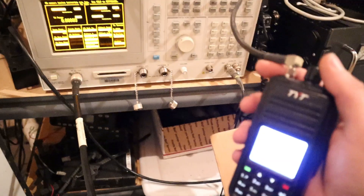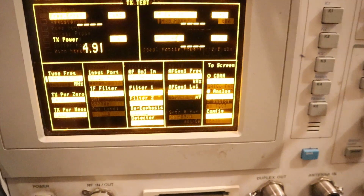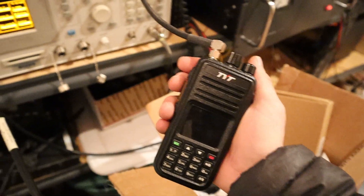For each mode, a radio will be set up on both the transmit and receive end, separated by a few miles. On the transmit end, each radio has been tested for frequency error and output power at 5W, so all radios will be transmitting the same output power. On the receive end, radios have all been tested for good receive sensitivity. This will be a mobile multi-path test throughout a city environment and rugged terrain, giving a better idea of true coverage. If we were stationary, we might be in a null or a peak — moving just 2 inches can change the result — so we have to do it while mobile, driving at a constant speed.